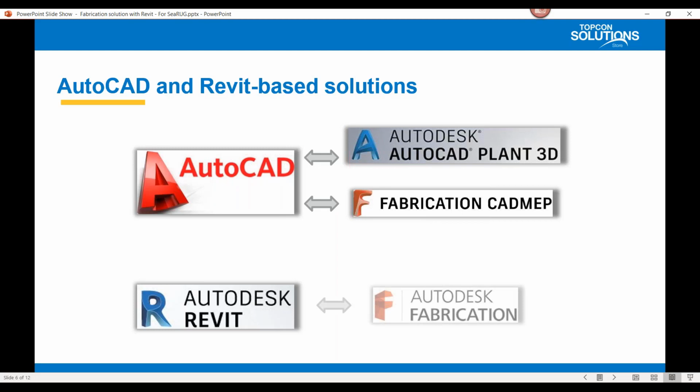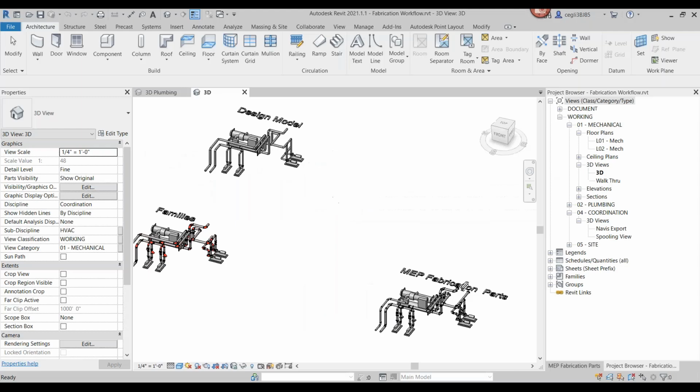Now, down on the Revit side, I put up a bullet here, Autodesk Fabrication, which is just the tools and the engine under the hood that I'm referring to there. It actually is just part of your Revit. You don't have to use it, but when you install it, it's there. Here's the kicker, though, that's really key to this: the database under the hood is shared by both of these. If you're working in AutoCAD and getting some of it done there, maybe you're using CAMduct or something like that, the databases you create or start up and then augment with additional parts and items will get shared over into Revit, and we can use them over there. I'll show you a little bit of how that works here. Let me come over to Revit, and we'll get right into it then.